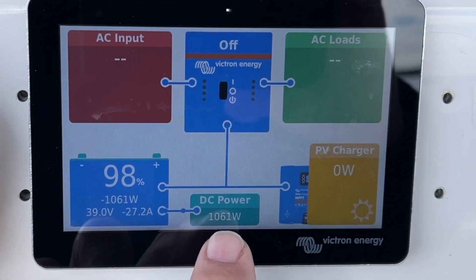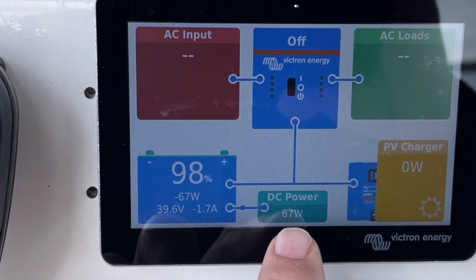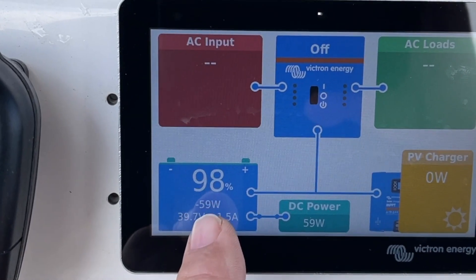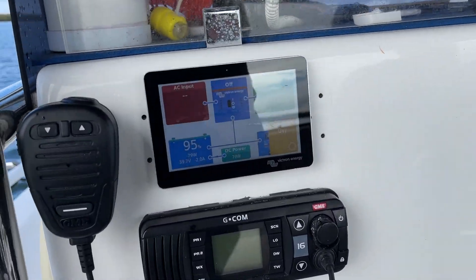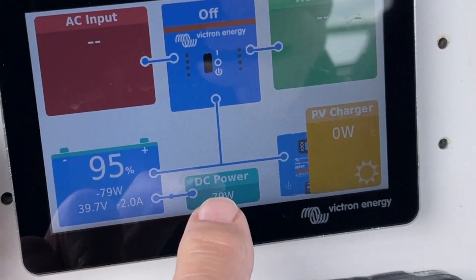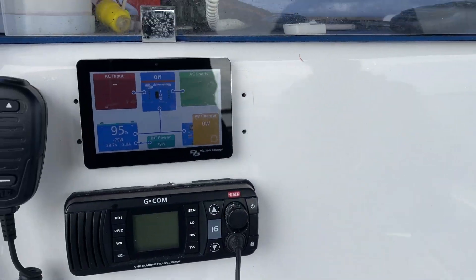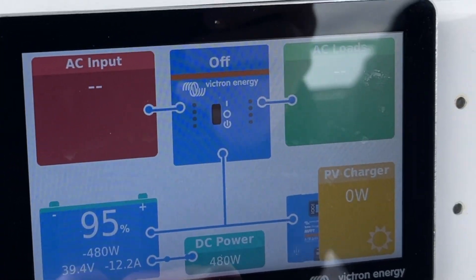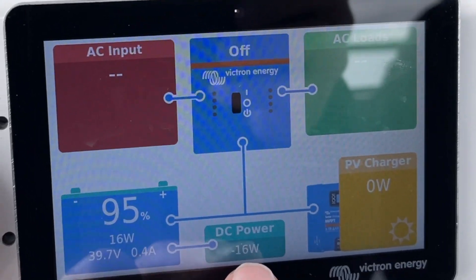You can see the power varying a bit as it comes back up. We've now retracted the Minn Kota, and you'd see now what's happening on Scotty here — you'll see a positive number: 79 watts. So we've got 79 watts flowing out of the 36 volt side, and that's going into the 12 volt side running the sounder here. We're going to start up now — let's start up. You'll see there was a big surge of positive power going into the starter battery.